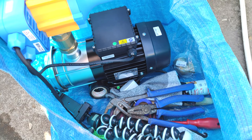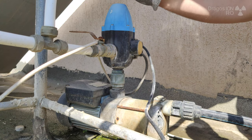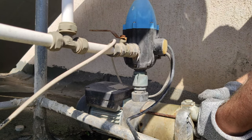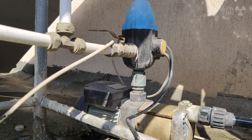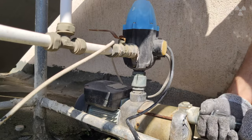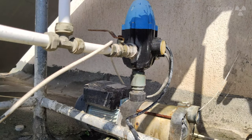The new pump and this is the YouTuber kit with the tripod also. Closing the valve going to the water heater, and now I'm disconnecting the inlet. This is coming from the water supply - it's actually from a water tank, so there's not much pressure here. If this was connected to the main water supply, you have to turn off any valve you have on the way there.